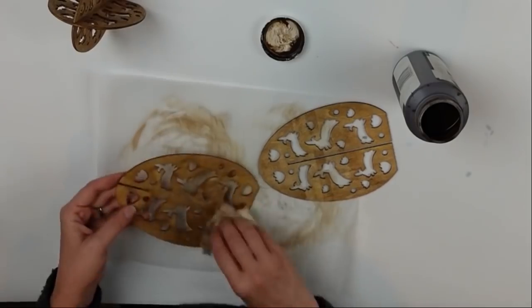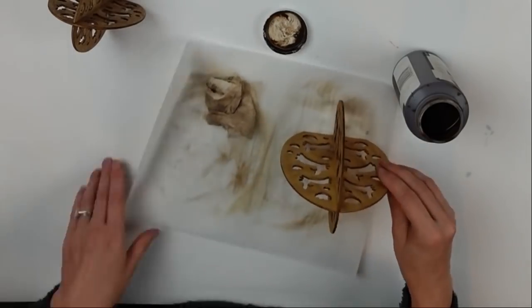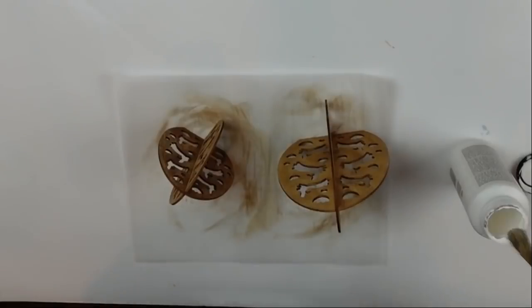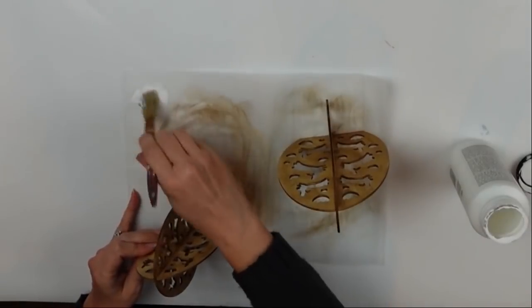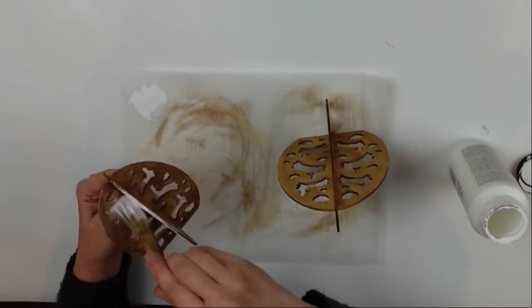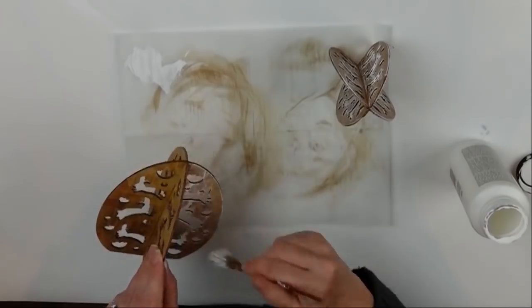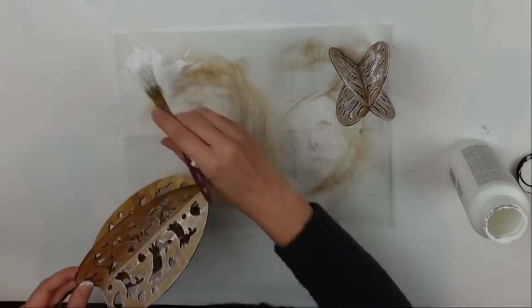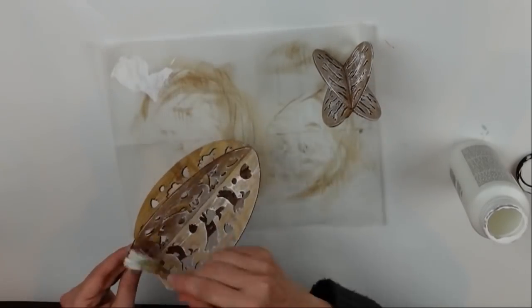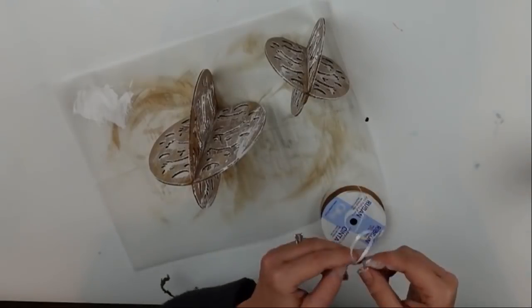One of my subscribers recently asked me why the baby wipes, and it just helps the wax to glide on easily and not with a really heavy deposit. So you have a little bit more control over the color of the wax, the depth of the color. But then, as I mentioned, I came back in with some of my Adirondack white chalk paint, and I distressed it just with a really dry brush, just sweeping over all of those surfaces.